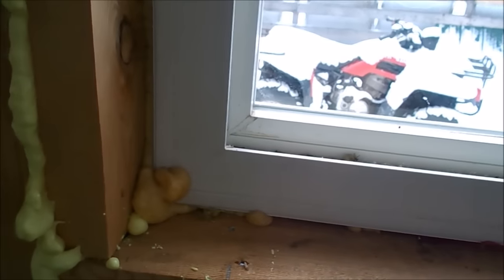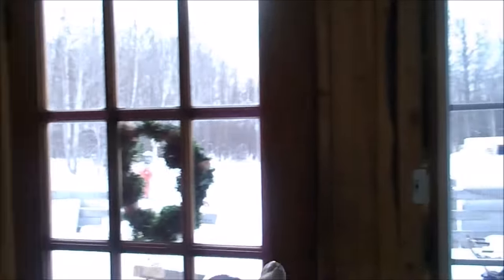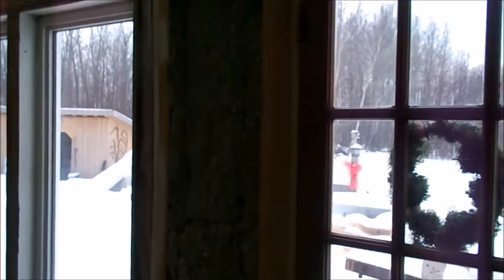Anyway, we got this all studded in. I have to pull some of this insulation back out — I pushed it in too far in this one spot. Heather did the rest, I did these two, and she did the rest. Pretty much we're all set to put vapor barrier up. I'm going to fix a little here, add a little more there, put vapor barrier up, take the screws out of the top header, trim that foam, and put the OSB up. We'll be done right to here, and there's just from here to there to do. I can probably do that strip today, and then it's just around the door I'll have to do.